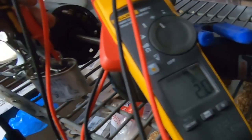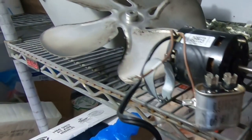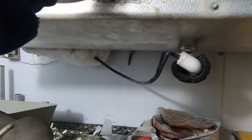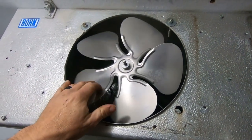They're cheap enough that it's not worth taking a chance of having to come back later. We're checking it and she comes in at two microfarads, so we're good. Motor's junk and she's hot. This one here, we're kind of screwed with the frame. What I've seen done before is you can wire tie it - there's really not a lot you can do other than just replace it.